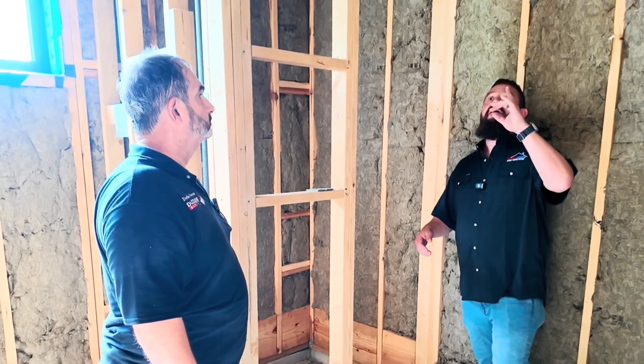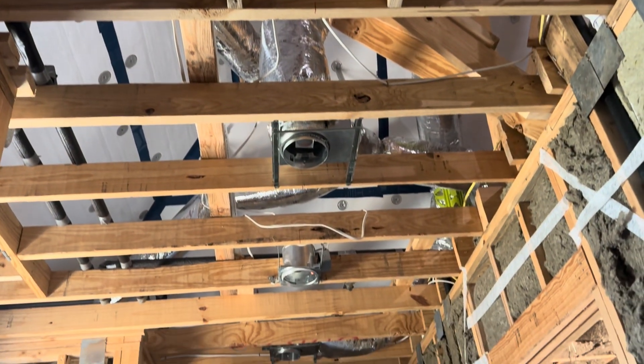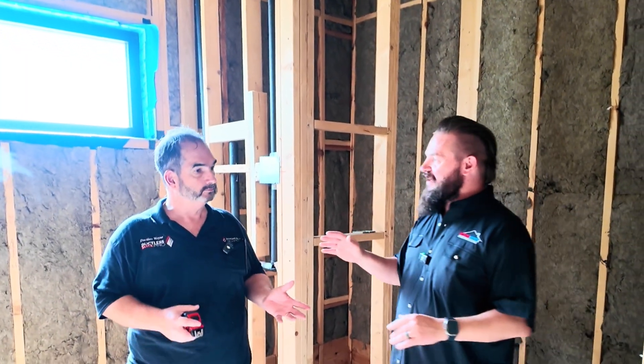What I find interesting in here is keeping with the aesthetic — we have a dummy, but we also have three supplies. In a normal bathroom you wouldn't typically see three supplies. The reason we do is because there's a larger duct running over here split off into three. We need to keep this room pressurized for the exhaust to work correctly so we don't have smells going into the dwelling. You don't want that — taking care of the homeowner is priority number one.